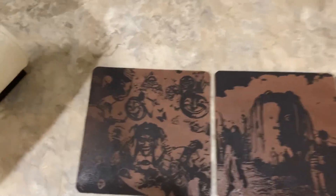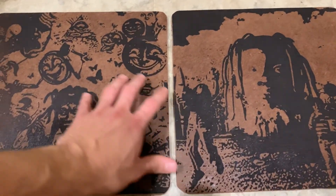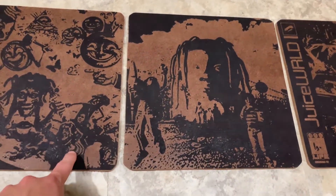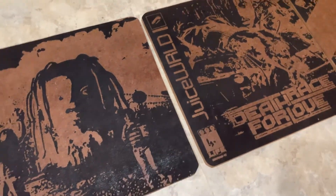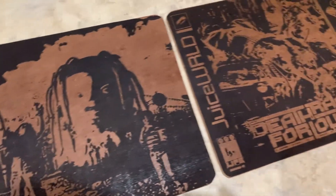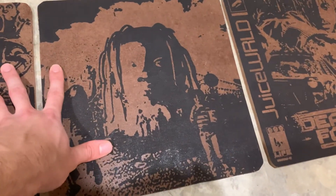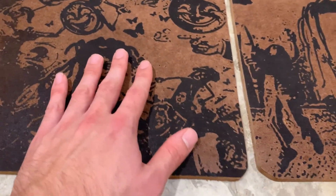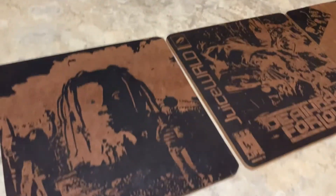That's how you make album covers with the Laser Master 2 — you can probably replicate this on any laser. These are 11 by 11 inches and take about two and a half hours each, depending on how much burning there is. If you have a lot of black in the album it's going to take longer. The clear coat dried pretty well, and you could sand them down and do them again to get them smoother, but as of now these are looking good.